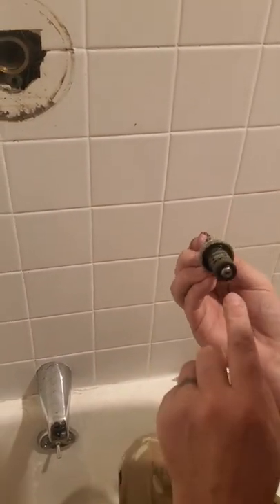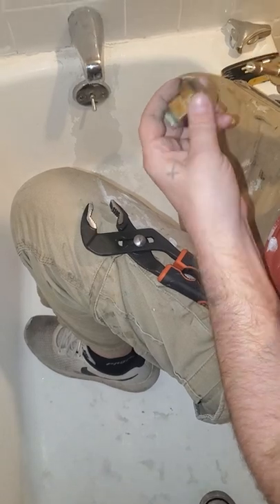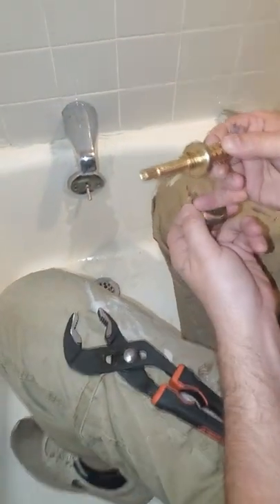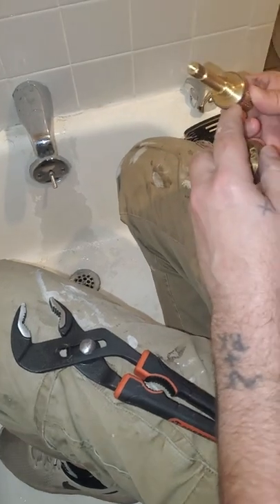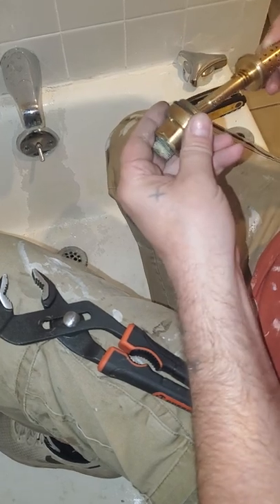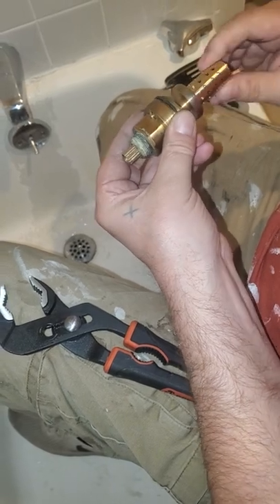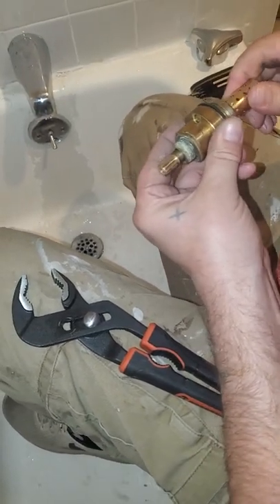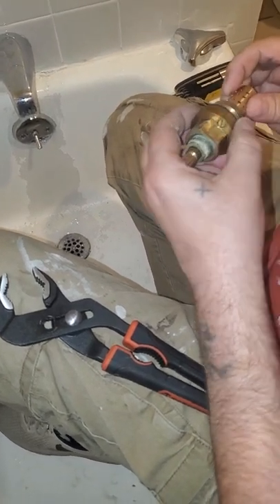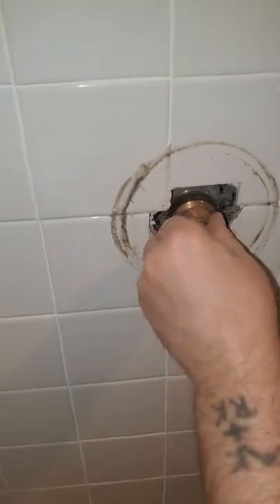This doesn't look like it's having a closing issue as well. So let's go ahead and open up a new valve and we'll install that. Okay, so I did clean this off a lot here, got it nice and flat so that it will sit up against this. Remember, the old one was all decayed and all messed up there, and it just wasn't going to sit in flat. So go ahead and screw this all the way in so it touches. Once it touches, then you can go ahead and replace the cartridge — right back, nice and simple.